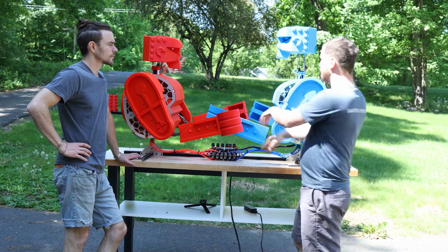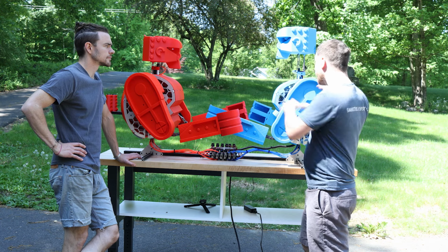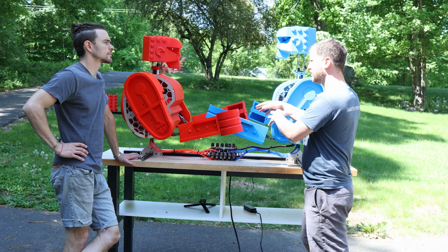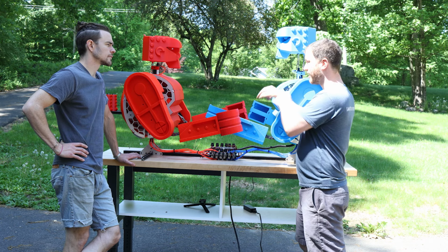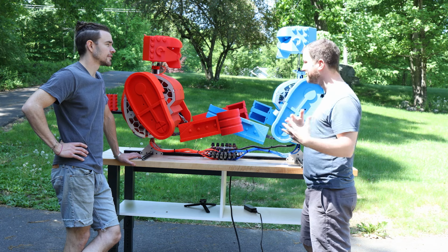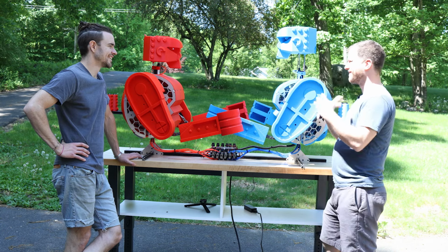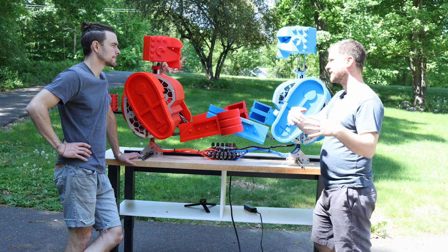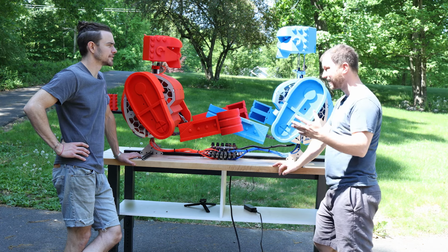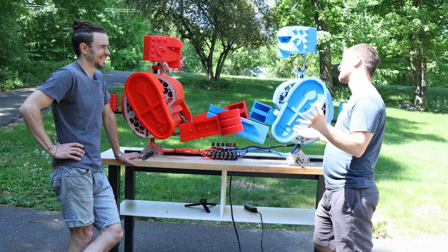I was tempted to put in, so there's the microcontroller, which is like the brains of it, and I have microcontrollers that can connect to the internet. And the way I've built this, the buttons don't directly control the arms. The buttons are actually being read by the microcontroller. So theoretically, had I put in an internet connected microcontroller, I could play somebody across the internet. They could be pushing the buttons on their keyboard remotely and playing the red robot, and I could be playing the blue robot. The problem though is latency. Between them pushing a button on their keyboard, it'd have to be transmitted over the internet. I mean, it would probably be maybe a half-second delay at the best. Whereas my buttons are being read in real time, and it wouldn't be a fair fight. So that's one of the reasons I decided against doing that.